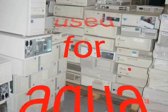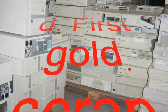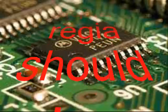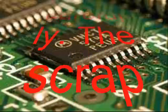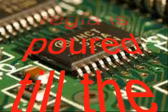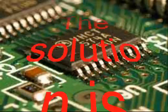Either Teflon plastic or glass can be used for the aqua regia gold recovery method. First, gold scrap should be placed in the digestion pot and then the aqua regia should be poured onto it slowly and very carefully. The scrap metal starts dissolving in the aqua regia, which is poured until the whole metal is dissolved.